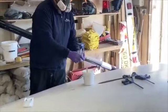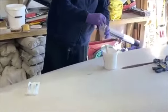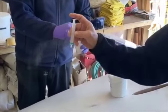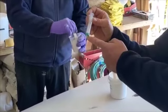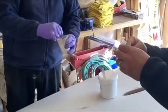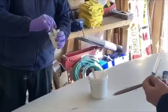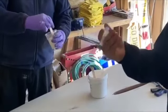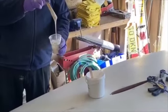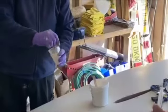Okay, so you can still see it's pretty runny. In fact, you do not want to make this too thick, because we're going to use a syringe with a thin nose. Matt is going to, once that's mixed, fill this syringe up. The whole point here is that nozzle will fit into that gap we've created, and we will literally inject it in. We want the new bonding paste, Grant, to not just sit on the surface, but actually flow all the way down.